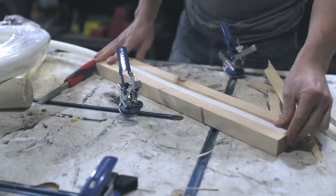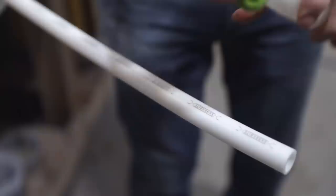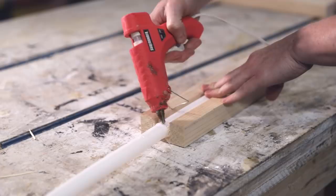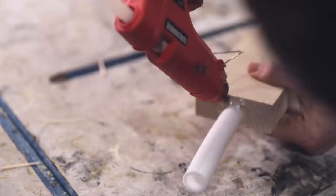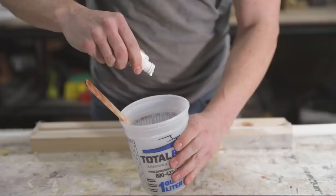A little more about that tubing — it's called PEX tube, and I'd seen folks over on the FastLED group on Google Plus using it as a diffuser. It has a little bit of ink on it; you just use nail polish remover to take that off and then it works as a pretty good LED diffuser. I put it into the channel and then used some hot glue to create a dam to prevent epoxy from flowing out of the channel when I pour it in. The exothermic reaction of epoxy does melt hot glue a little bit, but if you're careful and do it slowly it won't melt fast enough to get through.